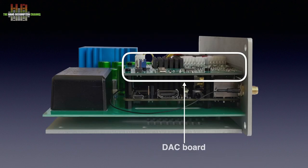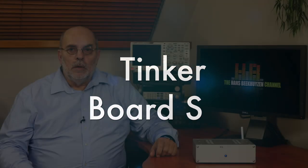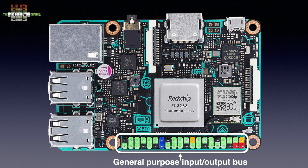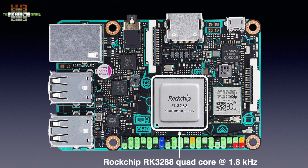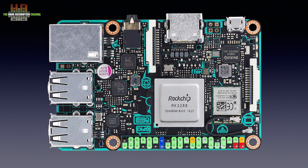To show this, let's go to the opened side of the DMC. Here is the DAC board we saw from the top, and below it the ASUS TinkerBoard S small board computer. You might wonder why the TinkerBoard S is used instead of a Raspberry Pi. The TinkerBoard has the same dimensions, connectors in the same place, and even the GPIO bus is compatible — but the processor is considerably faster: a quad-core Rockchip RK3288 running at 1.8 GHz with double the RAM at 2 GB. Where the Pi offers 100 Mb ethernet, the TinkerBoard can do gigabit ethernet, and importantly, the ethernet port is not routed over the USB channel — a well-known limitation of the Pi.